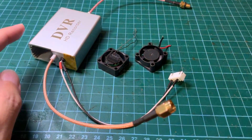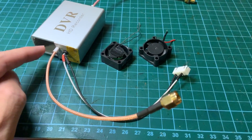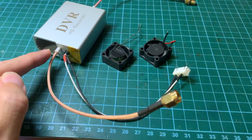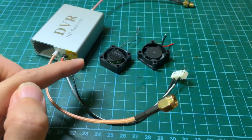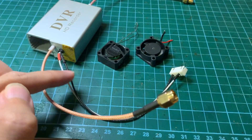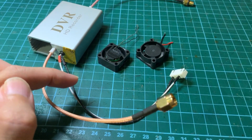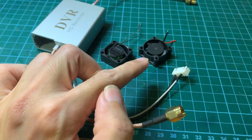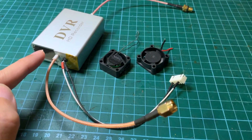Finally the 4 watts amplifier is complete with the new aluminium case. You'll notice there's an opening here for airflow, so I plan to use one of these fans to cool down the main board inside. This is the 12 volts version and this is the 5 volts version. When I tested the 12 volts one by tapping its power from lines running 12 volts, I noticed there were lines in the video. So on to plan B — use this 5 volts fan and have it powered separately with a one-cell lipo pack, a small one to keep the weight down.